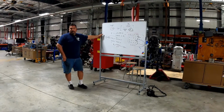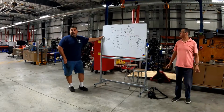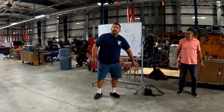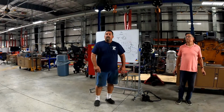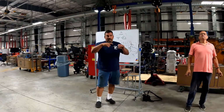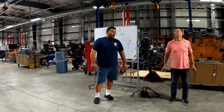You're talking about the steering for the IO. There's a ram in the back, but what controls the ram? The steering. The cable. Most Sea Rays, like IOs, have cables in it. The power steering pump's only purpose is to assist the cable. So you could have hard steering and that pump working properly, because the steering cable in the tube that goes into the ram is frozen, binding up with salt.